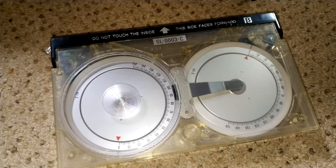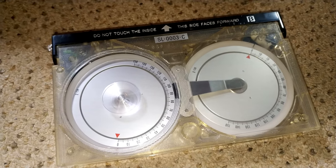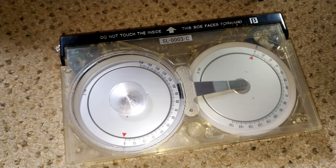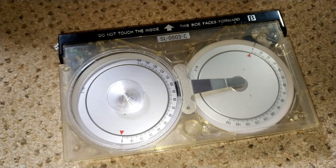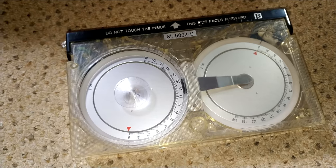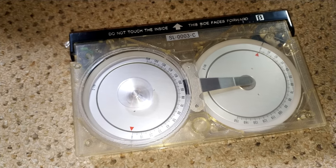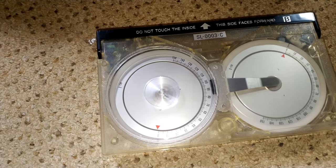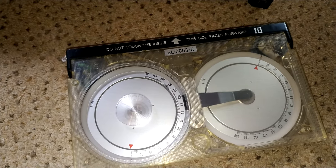So the other thing as well I said I'd do but didn't was check back tension, and I've got the tape, and again the manual isn't very clear on what the back tension should be. In fact, it doesn't even show using the cassette. It actually shows using open reel and gauge, quite different.